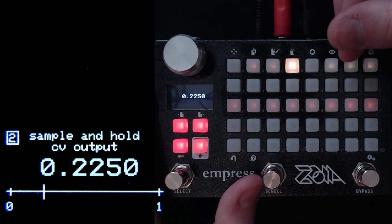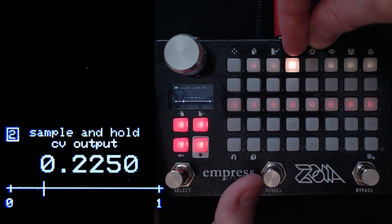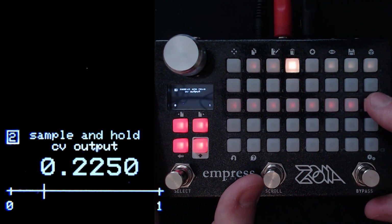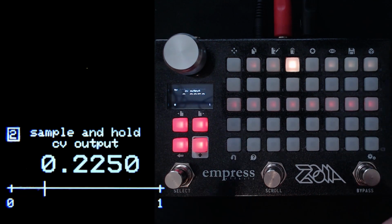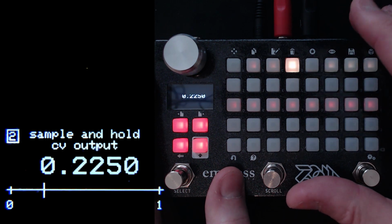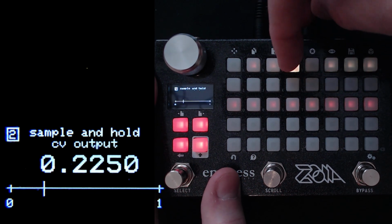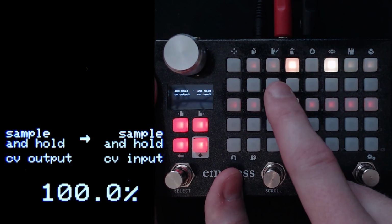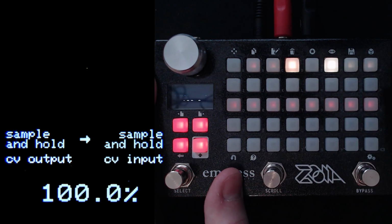but I don't actually have to use two gates for this. But the thing is, a keyboard, of course, the value in the note out value stays the same until you press another key. But for lots of different modules, the value is momentary, which means that in order for this to work in almost any kind of circumstance, you actually need two sample and hold modules. So the output value from the first one goes to the input value of the second one. Because even now, if this had been a momentary push button, for instance, and the value was transported here, you would still get the correct value out.